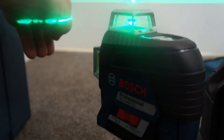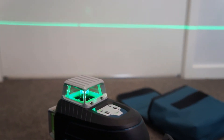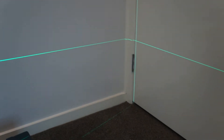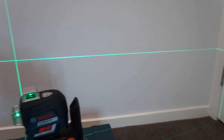The laser is shooting the line out on the door. If we just use these to tweak the laser, we can gently move it up to our desired height. So the top of that door — you can't really see it on camera, but that's touching the door. And at the bottom of the door it's 15 mil off. So that is why the doors open by themselves in this house. Let's quickly go see how out of level our doors and corners are. It ticks me off a little bit how bad things are, but it's not my house — you can see what people get away with when they just don't care.